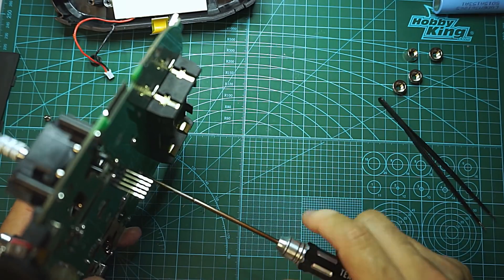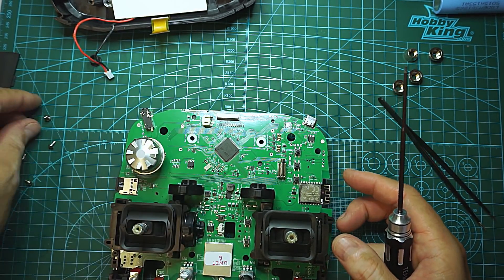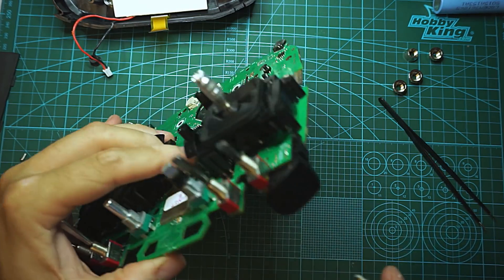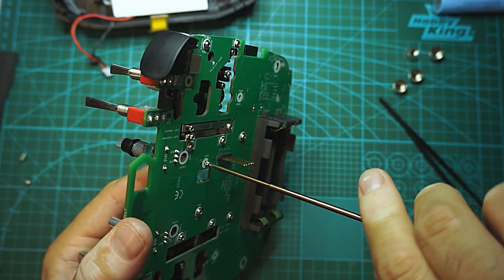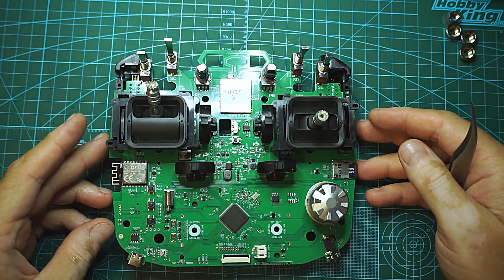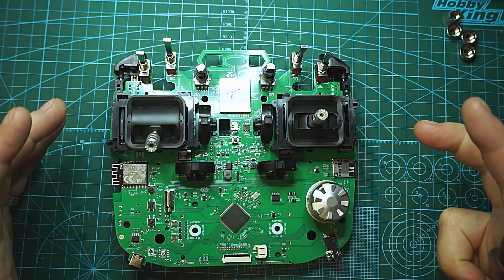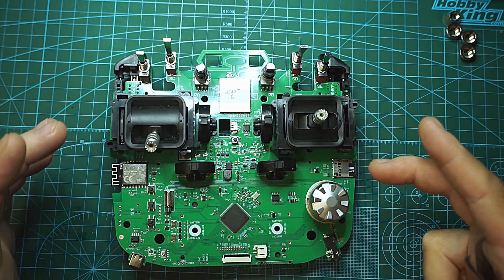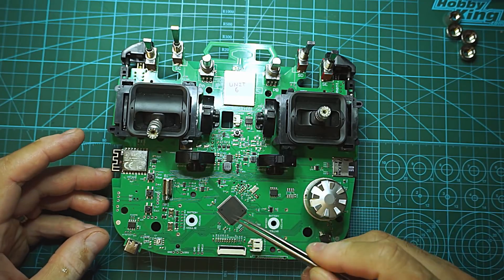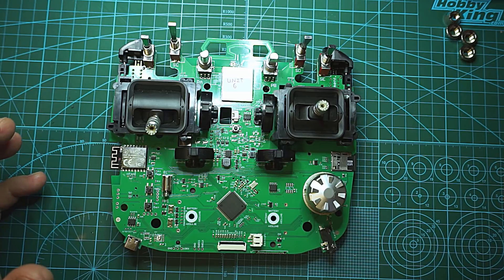These are the trim buttons, so when you take it off, only take out the screws that are marked 'front'. I always enjoy taking out stuff for the very first time because you don't know exactly how it is put together — it's like a treasure hunt. So this is the motherboard for the TBS Mambo. Basically we have the same philosophy used on the Tango — we have the main PCB which holds everything on it: the gimbals, trims, buttons. Everything is on one big PCB. We have the MCU which is the same as in the Tango, most definitely with a split firmware style — transmitter firmware and remote firmware, Wi-Fi and all of the jazz.